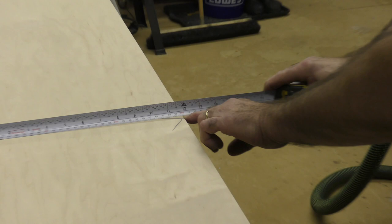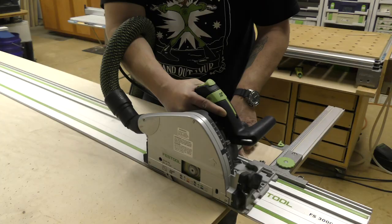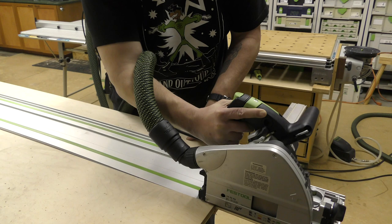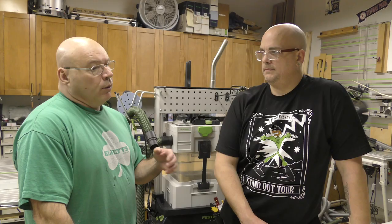One thing I always point out: if you had to rip 10 sheets of plywood at 300 millimeters, or in the midst of that switch to 400 millimeters for toe kicks and 600 millimeters for bases, you can get turned around on what's what. Always label your boards.